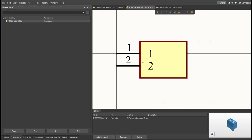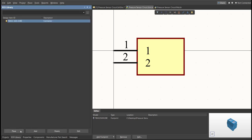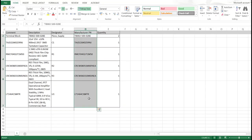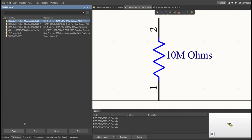The next thing we need to do is to edit the comment. Since this is a terminal block, we will put here the value of the component. Save this one. It is much better to edit the comment because it is much more readable when we place it in the Schematic Doc. Repeat the same process for all the components in the BOM list until you complete all the library. After you finish all the components, you can check in the Schematic Library Panel all the added libraries.